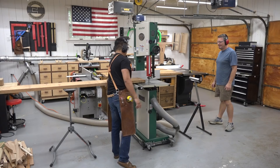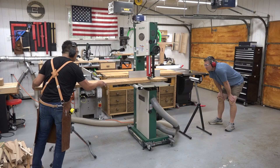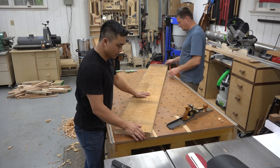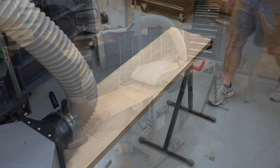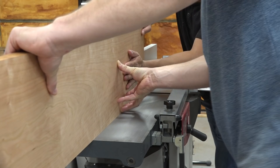I was fortunate enough to find several 12-inch wide boards to make up the tabletop. I first cleaned up the edges on the bandsaw to eliminate rough mill marks. These boards have a little bit of a twist, which I reduced by planing down the high spots at each corner with a hand plane — making the flattening process on my jointer much more efficient. I then planed the boards down to one and a quarter inches thick and jointed the edges for a glue-ready edge. A quick check with a square and I'm ready for glue-up.